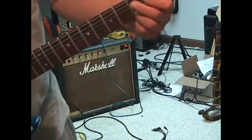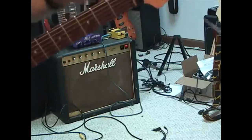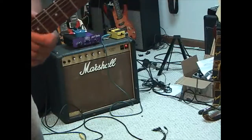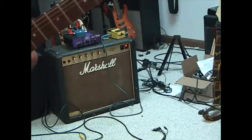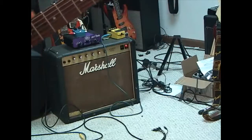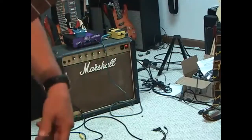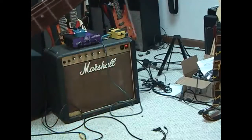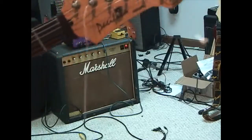I don't know how people played those. That's why even with the plexis, I don't know how you stand in a room with a 100-watt plexi. That's one of the reasons I believe that Eddie Van Halen originally used the Variac. You turn down the voltage on it, it softens it. He liked the tone of it, but also that's how he set his stage volume. Without blowing everybody away, he would turn it down. That would reduce the volume a little bit. And it turned out it gave him a little bit of that brown sound, softening some of the highs on that thing. So there you go.